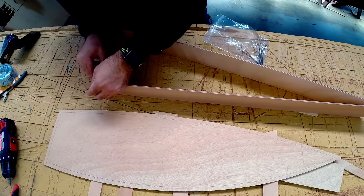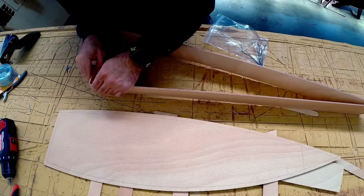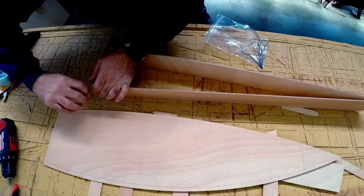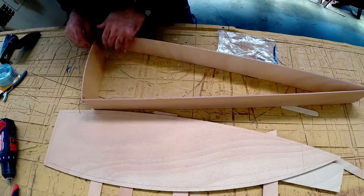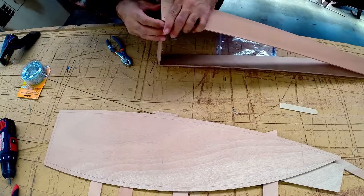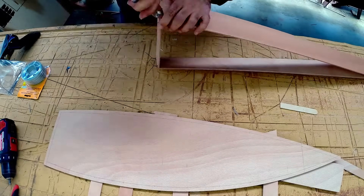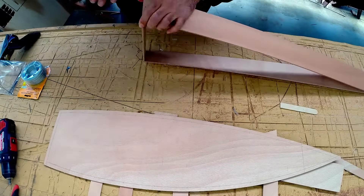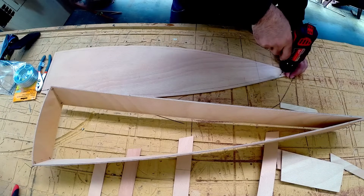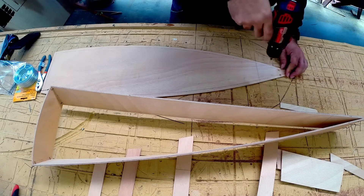The wire we're using here is a 19 gauge annealed wire. The annealed wire is a little softer and takes the twists and turns better, and is less likely to snap on you, especially if you've got to loosen it up and then re-tighten it. We're also going to be using a little bit of 18 gauge galvanized because we're running out of the annealed — the galvanized is what we had on hand, but it doesn't work nearly as well.